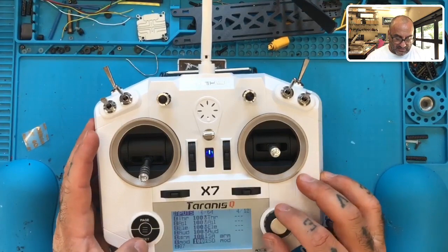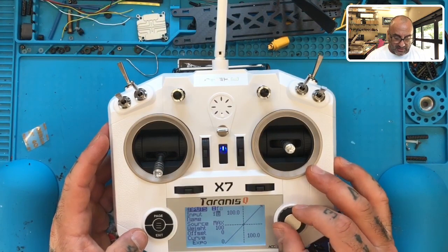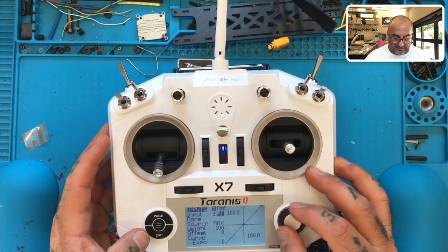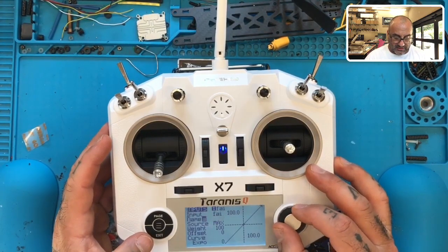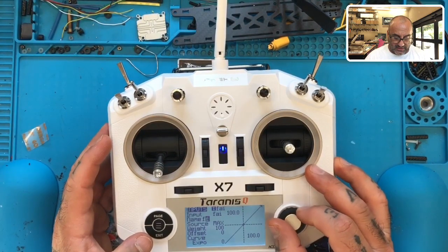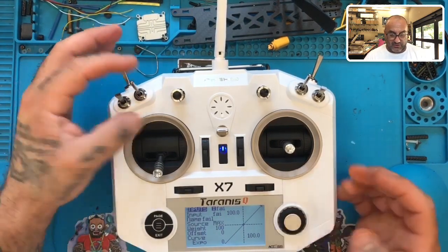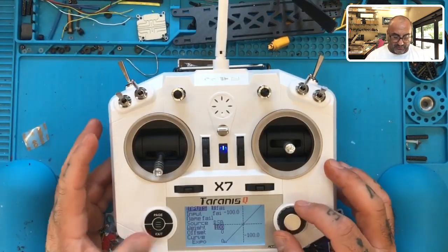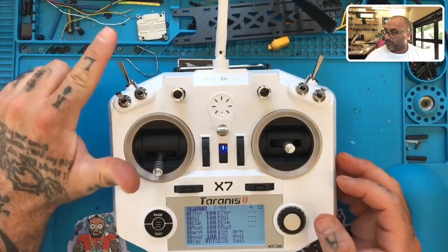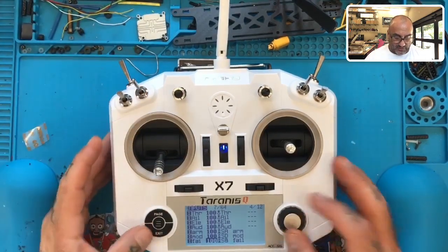So let's do that. And then the last one is going to be your fail safe. So we're going to title this F-A-I, and sorry, I didn't pick how many letters you could use, that's not my fault. Go back in here and name this F-A-I-L. Okay, and then that source is going to be this big one right here. So if you add a buzzer on this later on, the way this is configured, forward position is nothing, middle is buzzer, all the way down is buzzer with failsafe, okay? So that's how it's set up in your radio.